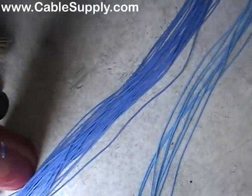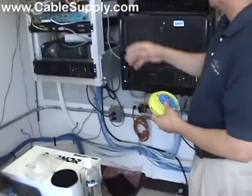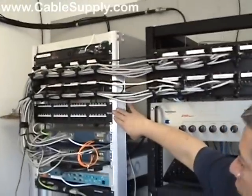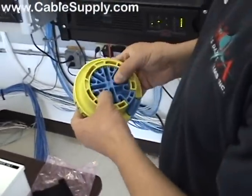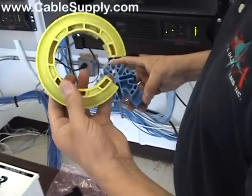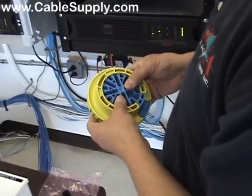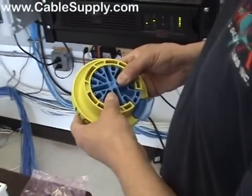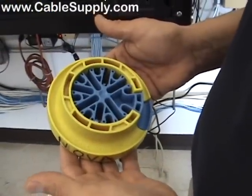You have all the cables on the ground like this, just to give you an idea, and they need to go into a data rack up there at the patch panel. What we need to do is make it look neat. Neatness counts in cabling because the neater it is, the easier it is to troubleshoot. So you put a little extra effort in making it neat and compact — when it comes time to troubleshoot, it's a lot easier. So let's take a look at this cable comb and see how it works.